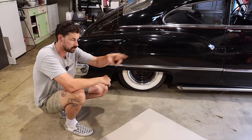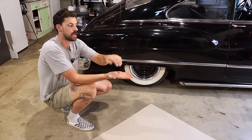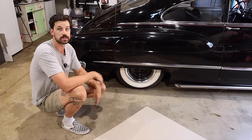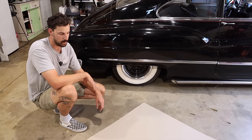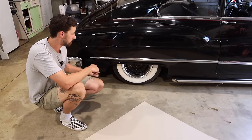And then I will do our initial profile, and then I can router around the edge, sandwich our metal between it, and then I'll have a little flange that'll come out all the way around, and we can hammer and dolly that, and that'll give us our shape. So what I'm gonna do is just make a few measurements, and then probably a couple different tries, until we achieve what we really want, and then we'll just tape it up there.